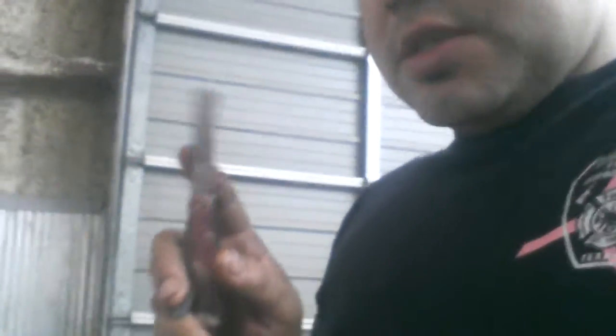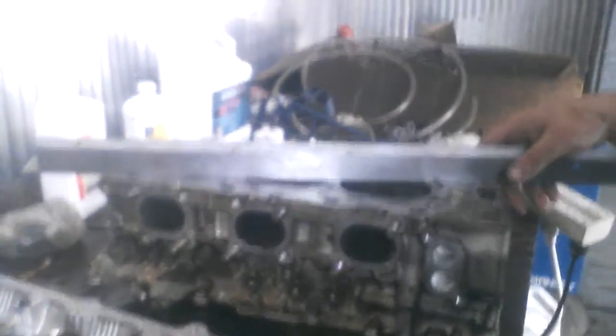With this, you're going to basically see if there's any warpage. If you have a head that's not warped, you don't want to take it to the machine shop unnecessarily — what if it's just a head gasket and your head's not warped? Regardless, I still recommend getting your head resurfaced, but here's a test you can do. It's quite simple. First of all, clean off the top of the head. I cleaned it off pretty good — make sure the surface is nice and clean without any bumps. Then you get your straight edge and just put it flat on there. You see, it is flat. As you can see with the camera, you don't see anything. It looks good.